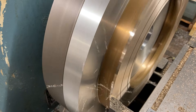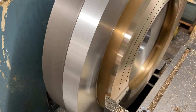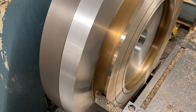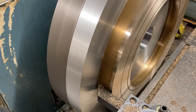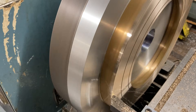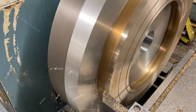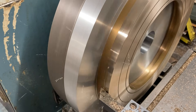So now it's going to rough that little chamfer in the front — one more pass. You had to actually finish it at 12.490 so I could clean something up. They probably were like 12 and a half inches originally. And then when they pounded them out, they went out to like 12.600. So I cut all that crap off before I started.